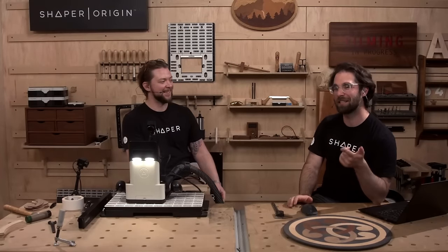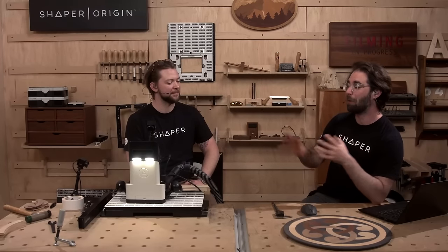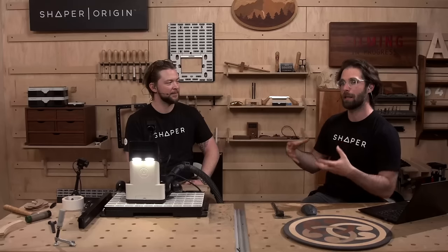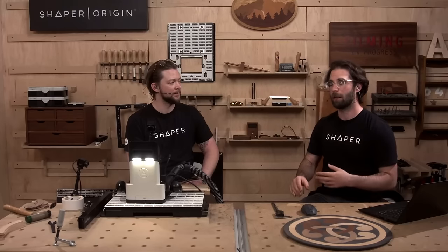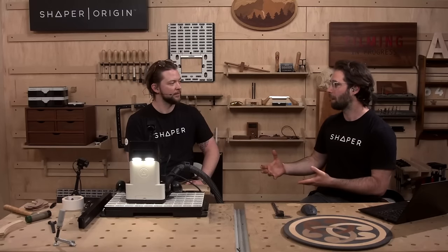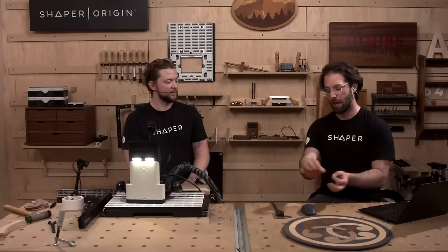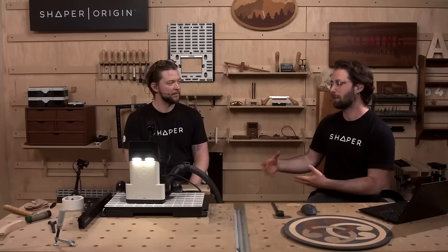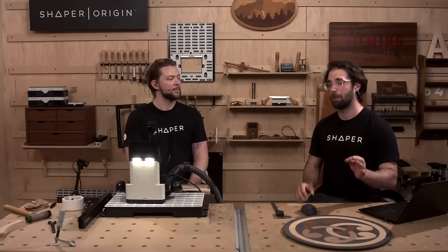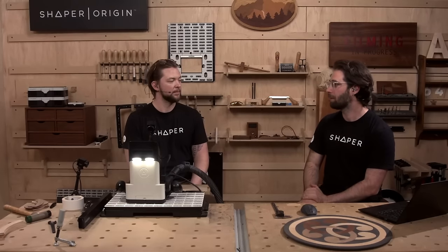And there was a really interesting technique in there. You might want to go back and watch this again after the end of the show. What we're going to show you today is pocketing with Origin, and that's removing all this material that you need to set the inlay into with Origin. But what Eric did there is to save a little bit of time, I think. He has a lot of routers at his disposal, right? So he did just the outline with Origin, and then came in and did the mass material removal in that pocket carefully. Now, mind you, you've got to be really careful with this, with a trim router with a big base on it, a big flat base. Yeah. So I thought that was a cool technique. Wanted to share that as well.